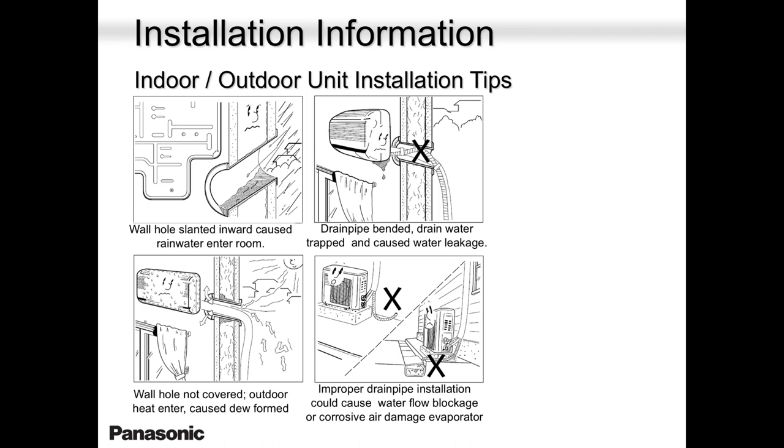This is so important. Many guys forget to do that. This drain has to be at the bottom of those two pipes and the wiring. The drain line has to be the very most bottom. So that way when condensation is taking place, it quickly sends out all that condensation without dripping here inside. These are minor things, guys. Very simple and very minor things. You don't need to be trained. You don't need to learn this in college. This is just a reminder. It's just simple logic.